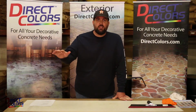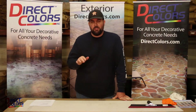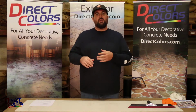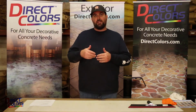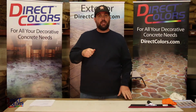Once everything is even, the cracks are filled, the pop marks are filled in, then you could come back and overlay it. It's important to do that little first step, because if you try to overlay over all the little unevenness or inconsistencies, it'll look great whenever you apply the material, but as the moisture comes out of it, it's going to sink a little bit, and then you're going to wind up with a little low spot, and you would have to come back and overlay that anyway.